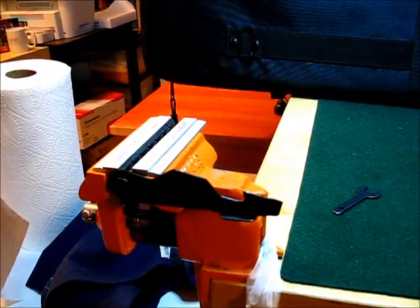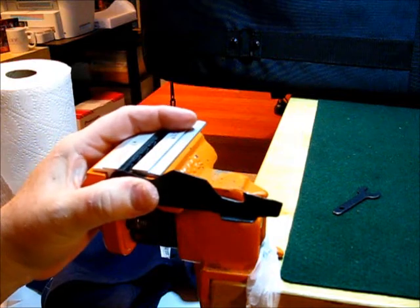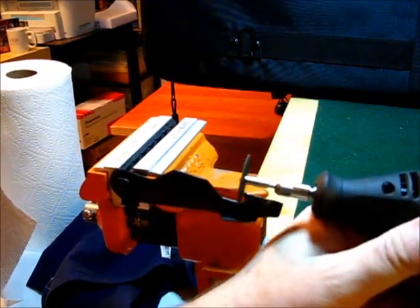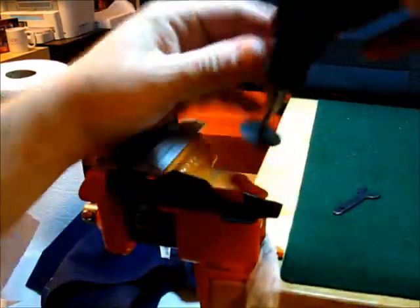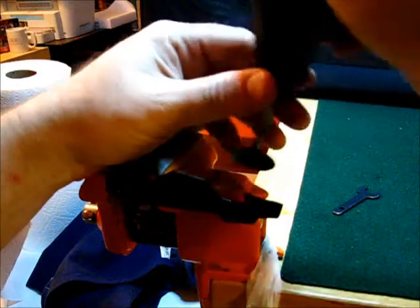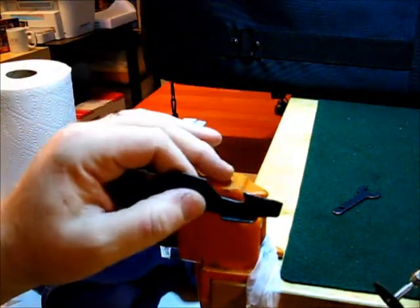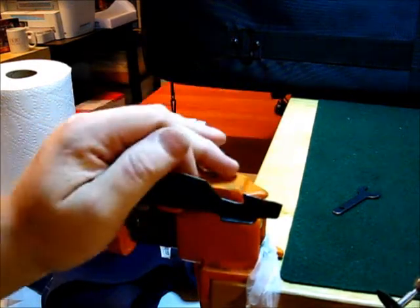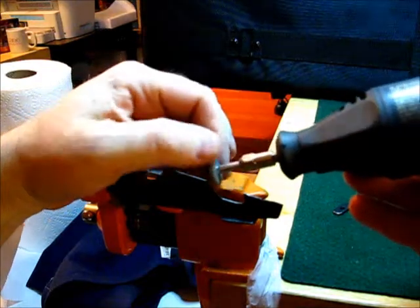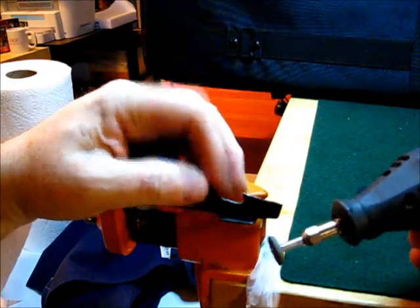Now you're ready to cut. Obviously this one is already cut, so I'll kind of fully demonstrate this. You want to lock your lever in a suitable vise and have a way to steady your hand on it. You're going to use a rotary tool with a cutoff wheel — go down and cut the first cut, then come back and cut the 45-degree cut. Then cut the bottom of the notch from this side, and then lining up the two cuts, come from the back. You don't want to cut completely through because you'll overcut the bottom. Once you get both sides milled out, you can bend this back and forth and the tab will come right out. Then put some kind of grinding or polishing bit — I like these rubber abrasive embedded wheels — and smooth out any burrs. Leave that tool in your rotary tool in case you need to make adjustments.